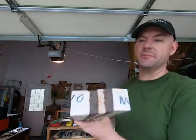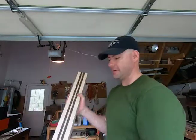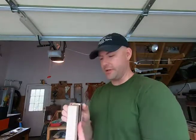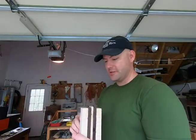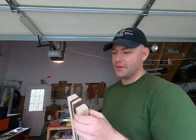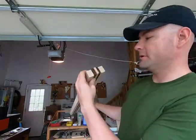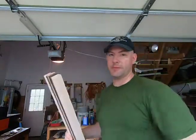And that's really something that I should have avoided from the start, but I think I might have been working too fast, because when you're working with a multi-layered joining project, you're kind of racing against the time of the glue starting to set up. So I might have gone a little too quick on that and started with a problem. So what I'm going to do is go ahead and flatten one face before I mill it.